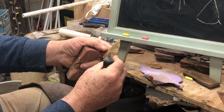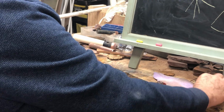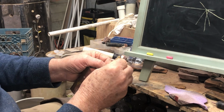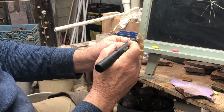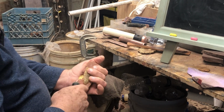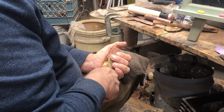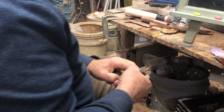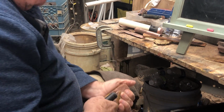You come over and do the other side. Now, the way I do this on the other side, we got a high area right here, a little area there, a high area right there, and a high area right there. This is high, low, high, low. So I'm not going to do a continuous platform. I'm just going to take the high spots off. I'm not even going to chip nothing off where it's low. So I'm setting me some platforms up here where it's low, and I'm kind of lightly isolating them. I'm leaving a little zigzag. So I sit right here.